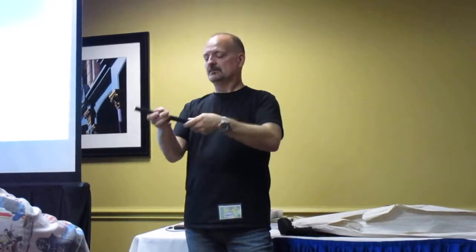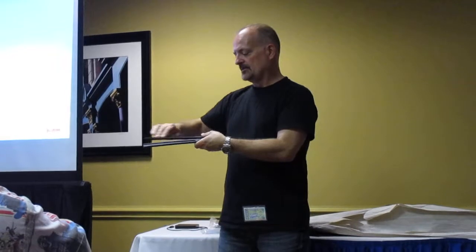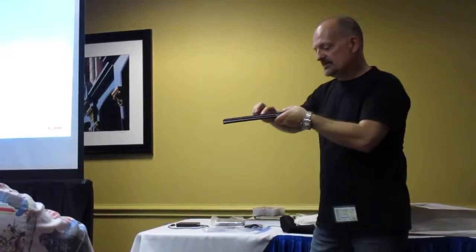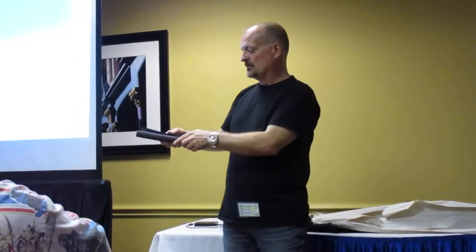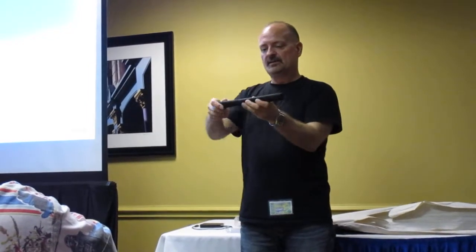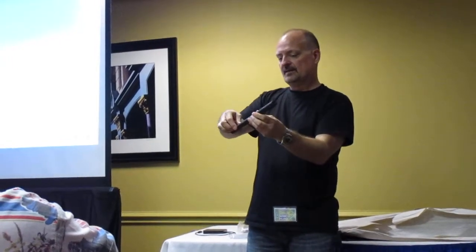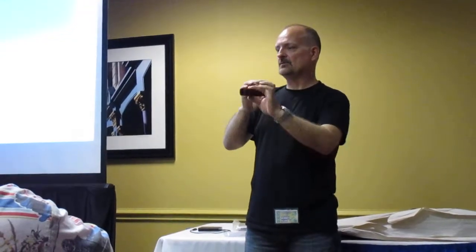Lay your blade down. The blocks don't even have to line up. All you want to do is lay the blade down, draw that shape out, go half the thickness of your blade, chisel that all out with your knives or whatever you're going to use, and do both sides. And the blocks could be like this, it doesn't matter, as long as the inside is together, and then you could turn around and cut your shape, both sides, the curve to get correct, and just sand away until you get your shape that you want.